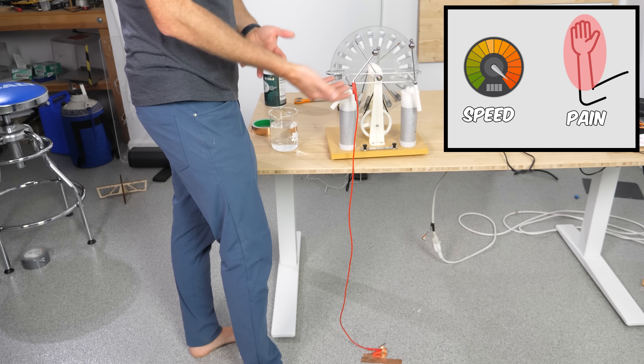So with higher voltages, the higher the voltage, the more current can move through you in a shorter time. However, to trigger those receptors, there has to be enough voltage for a certain duration. What if we could touch the high voltage electrode so quickly that it doesn't even have enough time to activate those pain receptors? Well, it would have to be really fast — in the nanosecond range. Obviously we can't move a finger that fast, but we can do something different: we can switch the voltage to be positive and negative very rapidly, hundreds of thousands of times per second. When we switch the voltage this quickly, it should prevent me from feeling the pain because the electric field alternates much faster than the nerves can depolarize.